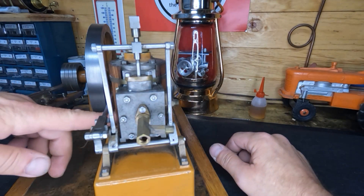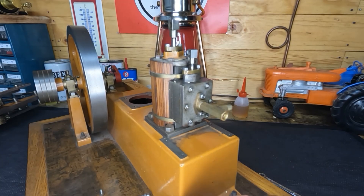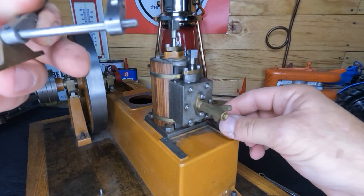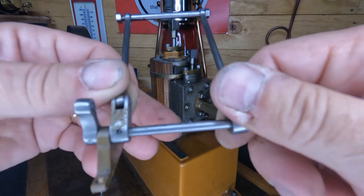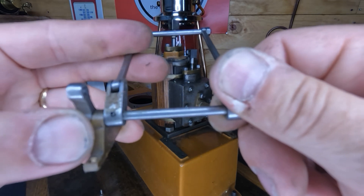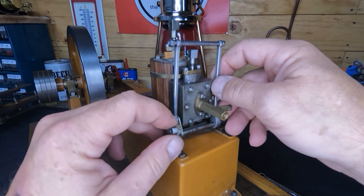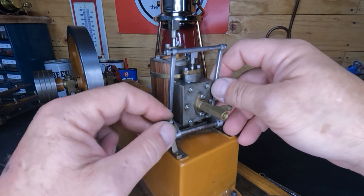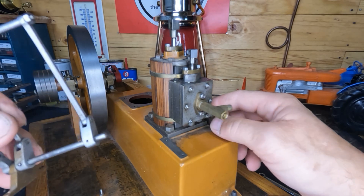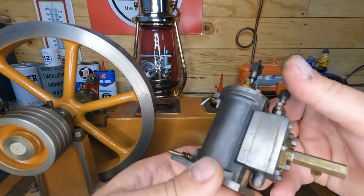Let me take our tie bar off up here, swing that out of the way, and then we're going to look at taking our cylinder off and opening it up. We've got our linkage off for our valve chest. Now I can take this bearing off the side here — you guys see the play in that. This side over here is solid, and when our valve rod moves up and down we want this to run together as a team. If it's loose like that, yeah, that's not good. There's one thing we have to address — it's not a big deal, we can do it.